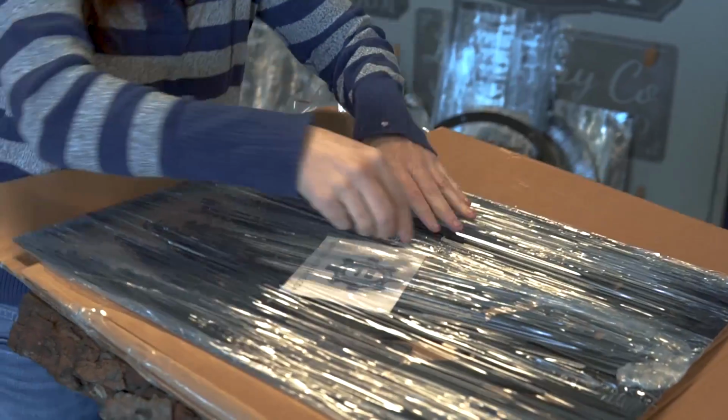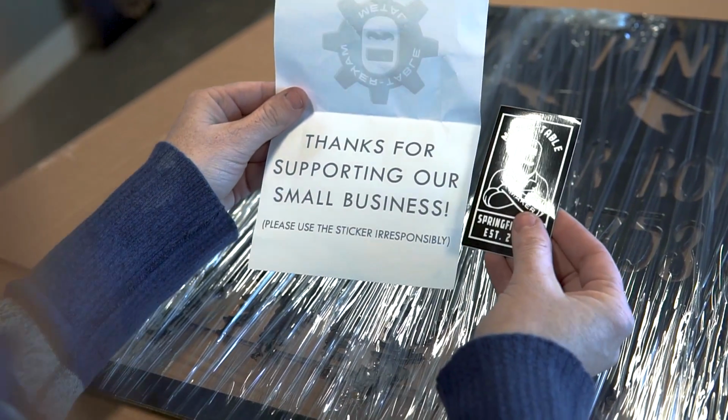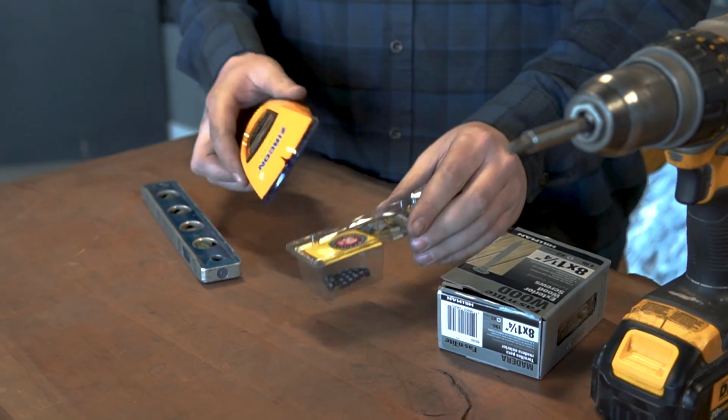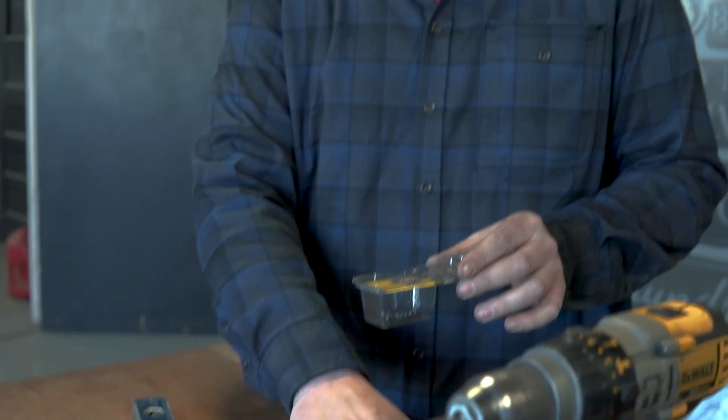The first option you have, and this is really the best, the gold standard, is to get yourself a stud finder and some regular old wood screws and find a stud on your wall, mark its location, and get at least one screw in a stud. You're definitely not going to have any issues with these signs if you find at least one stud when you're mounting it. But that's not always the best solution for everyone, and it's not totally required for any sign that we make under 3 feet.